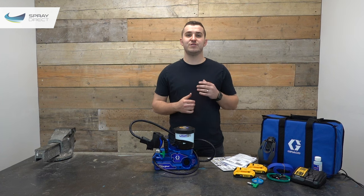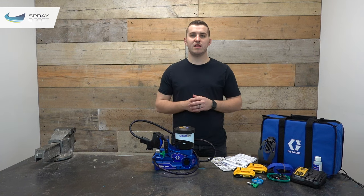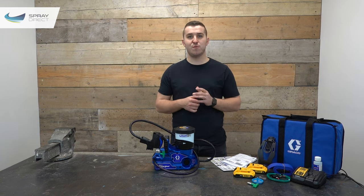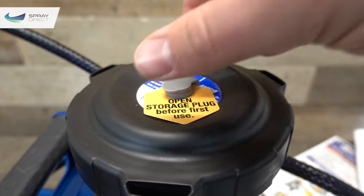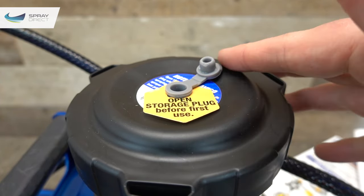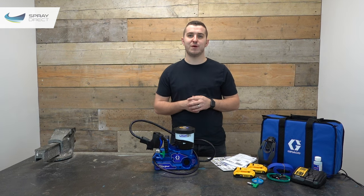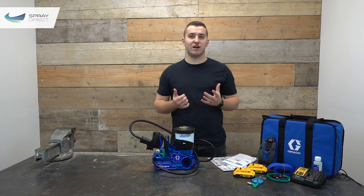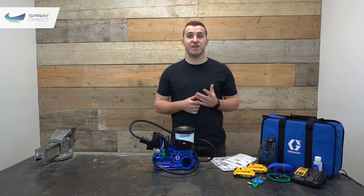The cup is gravity-fed rather than suction-fed, meaning material naturally flows down into the pump, giving us fewer issues with priming. There's also a small plug in the top of the lid, which allows you to move around or transport the Quick Shot without spilling material — but when you spray, you must remember to open it, otherwise you'll create a vacuum and no material will flow. With each supplied 2Ah DeWalt battery, Graco state you can spray up to 1 US gallon or 3.8 litres per battery, so for larger jobs around 10–11 litres you'll need a third battery or rotate them.